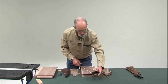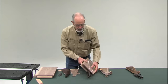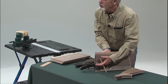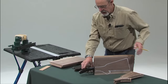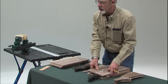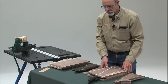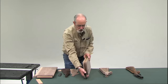You'll fit your receiver into your center piece and glue one piece at a time — put one piece up, glue it, clamp it, let it set up. Once it's set up, take your other piece and clamp and glue it. The reason you do one piece at a time instead of all three is because with your glue, you have a tendency to move the wood shifting around. This way you've got better control of your clamp-up and a better fit, because you want as close a fit as you can get.